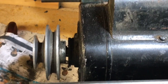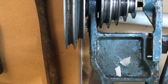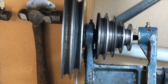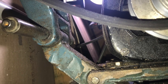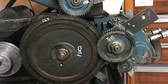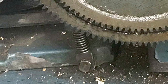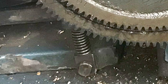Here's the motor with its two pulleys. This particular motor has a condenser sitting on the top. These pulleys connect to the idler pulley on the back, and you can get access to that one to replace the pulley without difficulty. The left-hand belt runs up from the motor to the idler pulley system. This belt can be adjusted using a screw underneath the big wheel on the gear train, and you can also adjust that belt by adjusting the position of the motor.